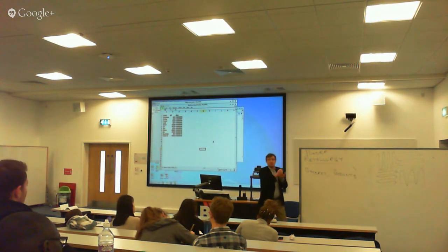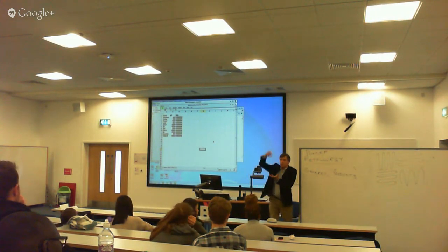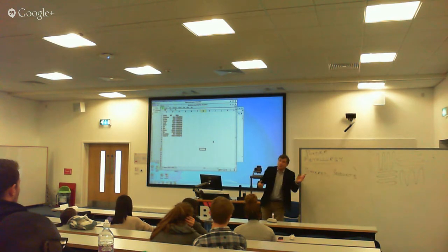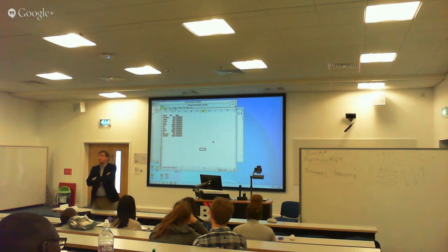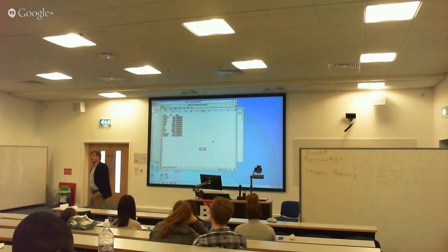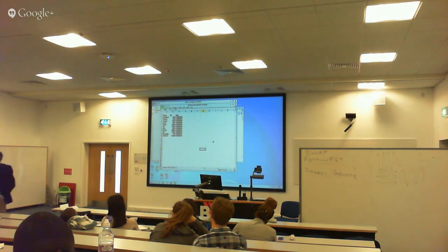This compaction, the first stage, both stages are very quick. An automatic machine pours the powder into the die, they call it tool, goes further, a machine comes and presses it, goes further, is ejected, and goes on a belt and is transferred into the furnace. So the whole thing is normally very quick. You can produce 40, 50 a minute if you get your production process right. So it can be quite good.